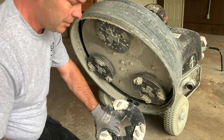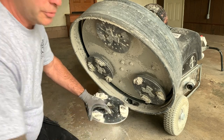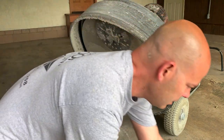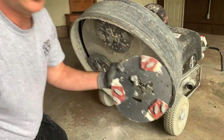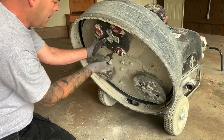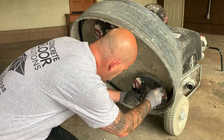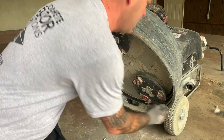We've got to choose the right diamonds. This concrete looks like it might be on the softer side. Right now we had 40-grit golds, which are meant for hard to very hard concrete. So we're going to take these golds off — they have quarter-turn dials on here to hold these plates on. I took off the golds and now we're going to put on the 40-grit reds. These just go on — take your tool and lock them in place. Now we've got the new diamonds on and we're ready to go.